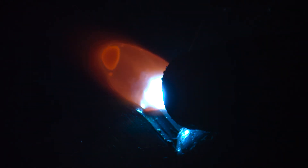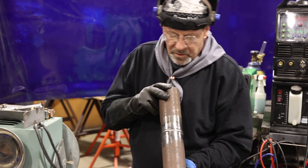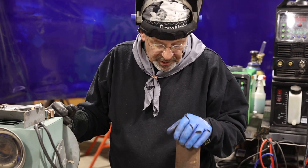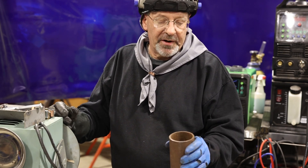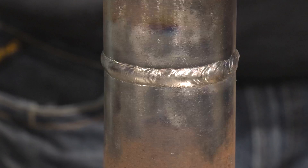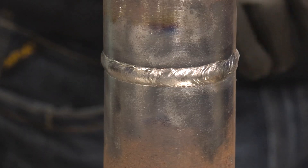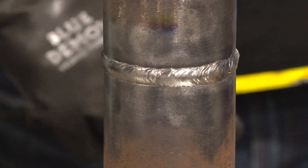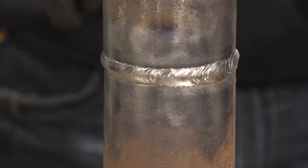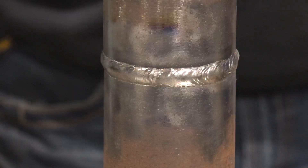Little half-moon motion there — we can go through circles. We finish the weld. So we produced this weld by rolling on a positioner turntable: we did a root pass, we did a cap, and that's literally all that's necessary on this thickness of pipe. With .030 wire I've done miles of this — this is prefab work, elbow to flange, anything you can roll. You need to do them quick; you make so much more money on them with a repeatable process. You get to the field, do a manual in-position short arc weld — everybody thinks it'll never pass x-ray or bend test, but it will. We've proven it thousands of times.